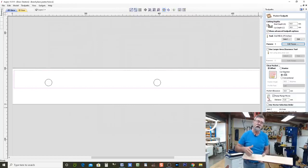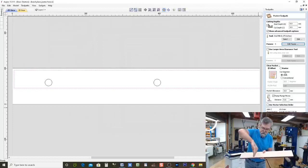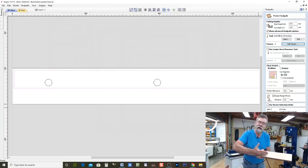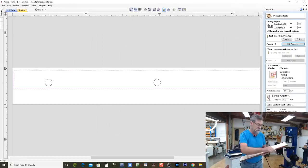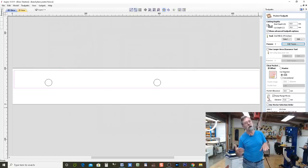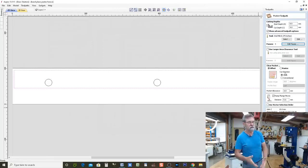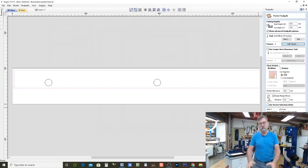But the advantage of using a climb cut with the machine that it's going to hold onto, it's much stronger than the spindle, is it's cutting in at the face and using itself as its waste, as its sacrificial part. So it's pushing back onto itself, rather than if it was going the other direction, it's going to suffer from tear out as it's going along, because it's pushing it out like that. So this way it's coming into the cut. It makes sense. Like if you've done a mason's miter on a kitchen benchtop, you'll know exactly what I'm talking about. The first approach on your right-hand side, you need to come in from the face, then you come from the back. If you start from the face on your right-hand section, it works.